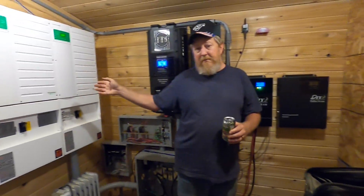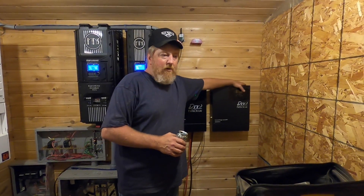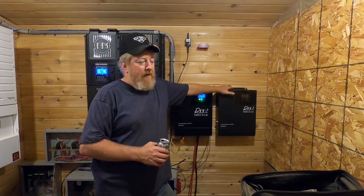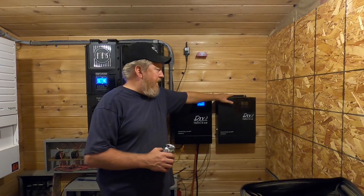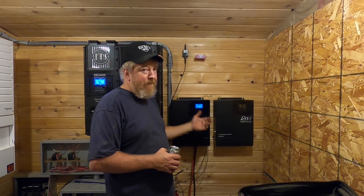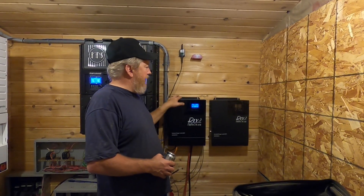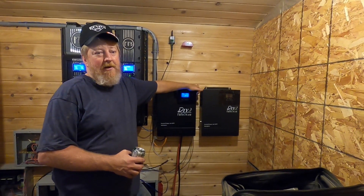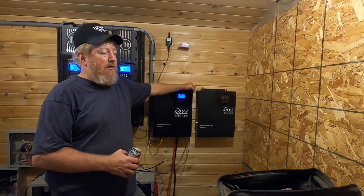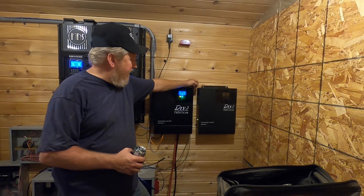The 5048 of course would be a better fit at 5,000 watts. We currently run the whole house off a 6,800-watt XW, so it's only 1,800 watts difference. We're excited — we're going to get Midnight's new 10-kilowatt split-phase dual 500-volt MPPT DIY unit, probably by mid-July. It's obviously going to be bigger, but also very affordable — maybe half again as much as this one or even double, but still very affordable. It actually sells to the grid; the engineers say it's going to pass ETL for anti-islanding to handle grid-tied sales, which is pretty cool.